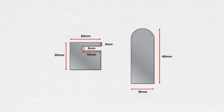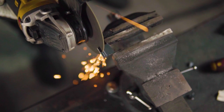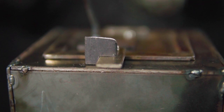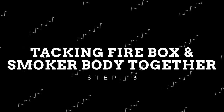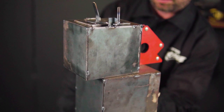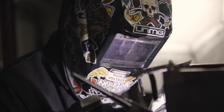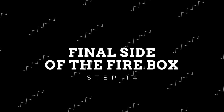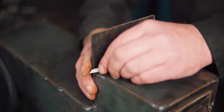The second part of the firebox locking mechanism is ready to be attached — cutting out as shown using a grinder. Now weld it to the door so the slot and lever meet easily. Finally, using some 6mm round bar or any other scrap, cut a small piece that can attach to the end of the tab to act as a handle. It's time to attach both the firebox and the smoker body together, tacking into place so that it correlates with the firebox intake. There is a rectangular hole on the back of the firebox — the easiest way to fill this is to use some 3mm mild steel, trace around the area, cut it out and tack it into place.